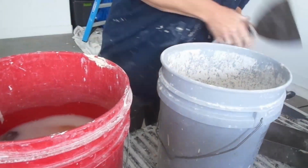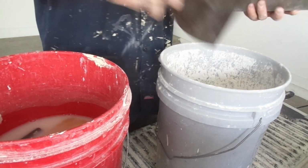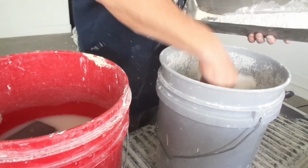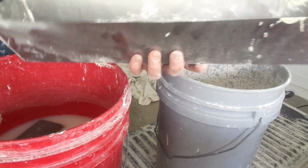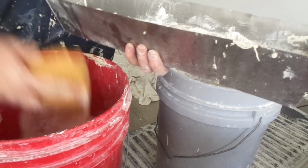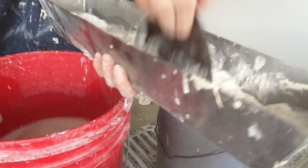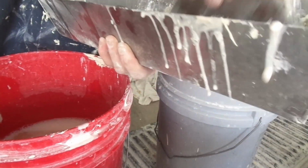Hot mud, I got a big pan here. I use an 18-inch pan. Most pans that you're going to get in the store are going to be 12 or 14-inch pans. So depending on how much mud you need, this one I'm going to need basically a full pan of mud, but I only do 3/4 of a pan of powder, and then you want to use fresh water. Dump it in, a good full sponge load of water in, then we're going to mix it, toss and turn with a 6-inch knife. Everybody has their own techniques on YouTube for how to mix hot muds.